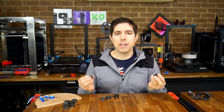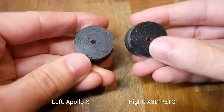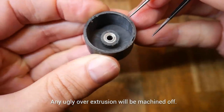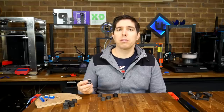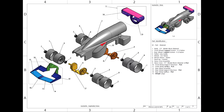If you're wondering about PETG versus Apollo X, I didn't really find any difference, so I stuck with PETG because it's more readily available. The only change I would make for the printing is upping the temperature and the flow rate to prevent any gaps between the extrusions and to give maximum strength. I would guess for most people this really isn't worth the effort, but for others with a specific application like this, it might be just what they need.